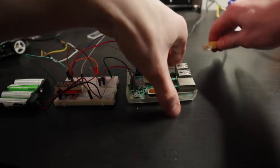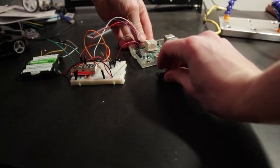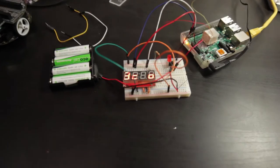Here, we've got the screen hooked up, Ethernet so we can talk to it, power. Nothing gets fried. All right, so far so good. It's going to go all crazy because it's actually taking the direct UART lines from the Pi, so it's going to take everything that the Pi outputs on the UART, which is a bunch of stuff when it first boots up. But then we can control it with a Python program, which should be pretty easy. You're probably wondering why I'm not powering the Peltier with the Pi itself — they draw a lot of current, so it's good to use the battery pack. I could use some external supply, but that's just what I chose to do. Less wires, I guess.